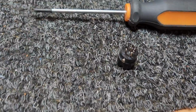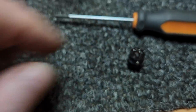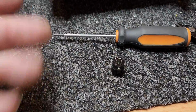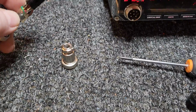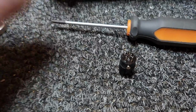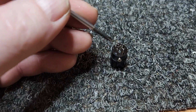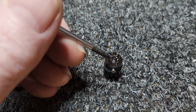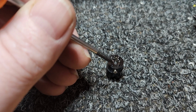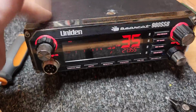Okay, so what I was mentioning before, if we know for sure that this plug is going to stay on this mic and that's what it's for, we're not going to do any mods to it, and someone may at some stage pull the lead and maybe try to wrench it out. Let's say the ground on pin 5 on these, so what's pin 5 over here, but let's say you wrenched it and for some reason the cable just got itself tied up. Maybe someone didn't solder so well, too big a blob, and it hits that 8 volt. Well, the regulator goes in this thing.